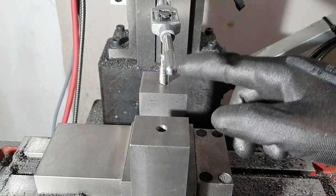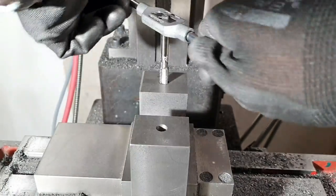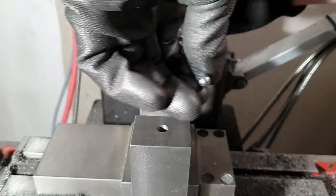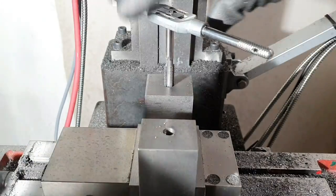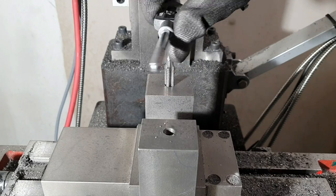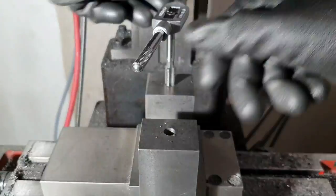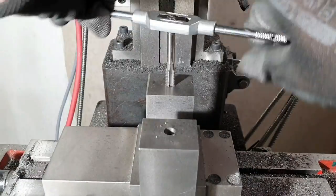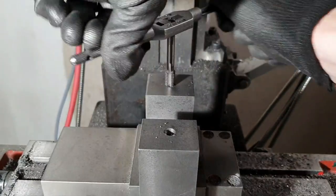This tap here got a nice taper so that it self aligns down in the hole, but it doesn't tap for final dimension. This is only like a pre-tap, or what it's called. So now when I have done the pre-tapping, this one gets down nice and straight. One just gotta be a little careful in the beginning.